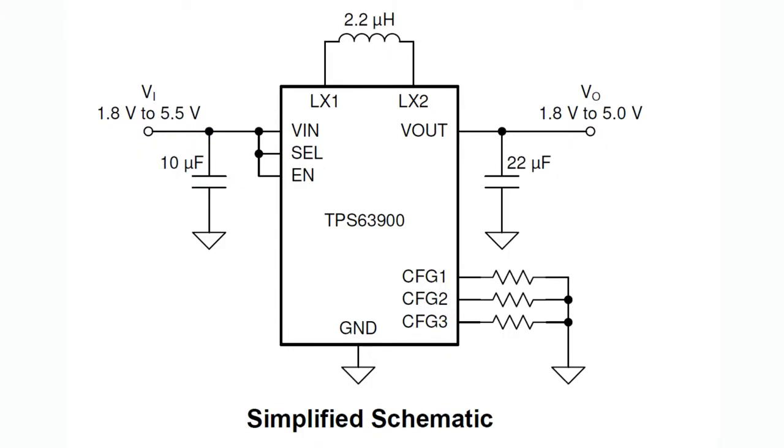Let's say you want a voltage of about 3.3 volts — a pretty common voltage for most electronics. But you're using something like a couple of alkaline batteries, or a lithium polymer or lithium ion cell. A lithium ion cell is going to be 4.2 volts when fully charged, which is higher than your desired output of 3.3V. But as the battery gets run down, it drops to as low as 2.7 or even 2.5 volts, which is below 3.3V — you want to boost that up. So no matter what the VIN is between 1.8 and 5.5 volts, the output is going to be a steady voltage. It will automatically switch between the two modes of operation to maintain that clean 3.3V output. This means you're getting the most power out of the battery. And something interesting: there are three configuration resistors — because this buck-boost converter has an interesting dual output selection mode.